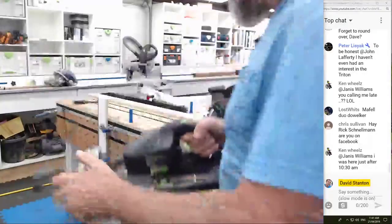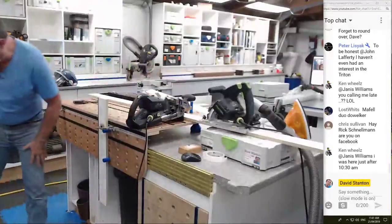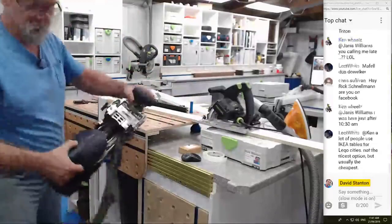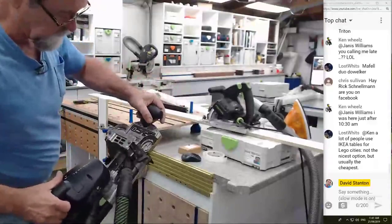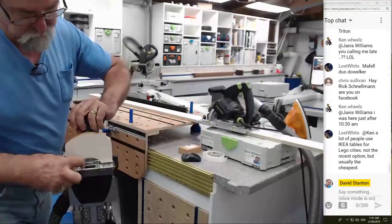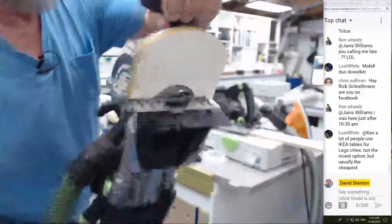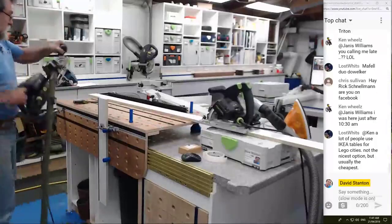It's very, very nice. And I need to put the airline on it. And it's hooked up onto auto start. And what else have I got? So I've got it on the tight domino, tight fit. And also, I've got the pins here out, which means I'm going to reference off the side. I'm hoping you can see that. Going to reference off the side and I'm working from the top down. So let's see how we go.